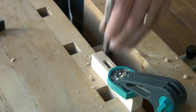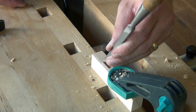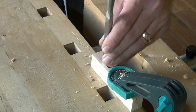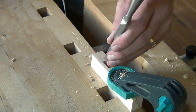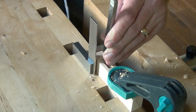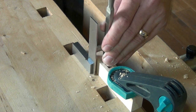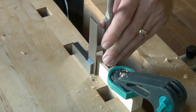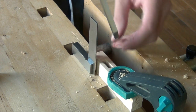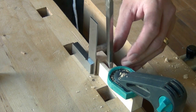We just need to finish up to the ends of the mortise. So we'll now go a little bit closer to our knifed line, not all the way. Just take a thin cut down just to relieve a bit of material. Then feed the chisel edge into the knife line. Set it vertical. And slowly drive it down to depth. Very carefully there, no pressure on the levering, so we don't want to break this nice end that we just created. Same at the other end.